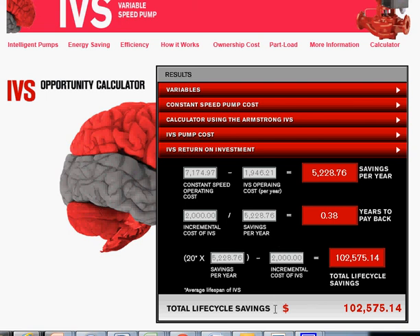As you can see, very significant energy savings. One of the most important things about the IVS is what it eliminates: it eliminates the remotely mounted DP sensor, the wiring from the DP sensor to the VFD or BMS, and the wiring from the VFD to the pump. It eliminates floor space required for remotely mounting the VFD by integrating the VFD onto the pump. It also eliminates sensor positioning errors and drops out the most frequent cause of problems in variable speed applications — the DP sensor, which is the most frequently failing item. Everything is integrated onto the pump; it's truly plug-and-play. Insert it into the piping, bring electricity to it, and the pump knows where to run.